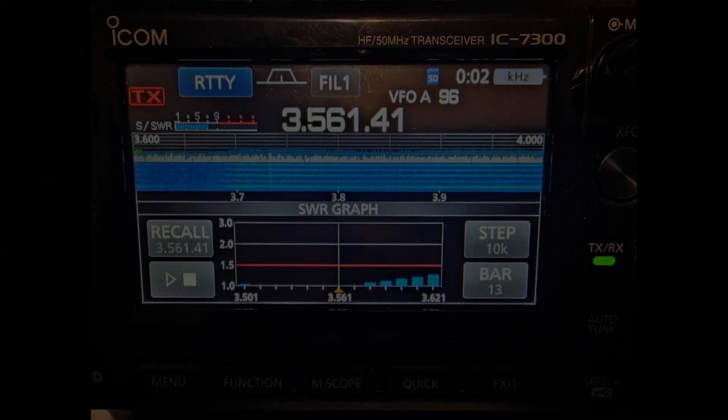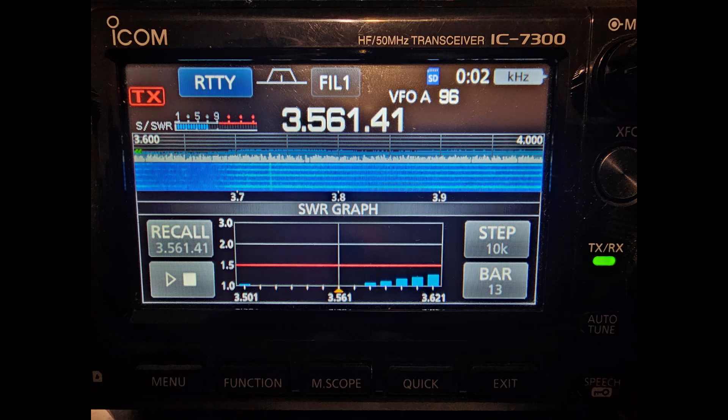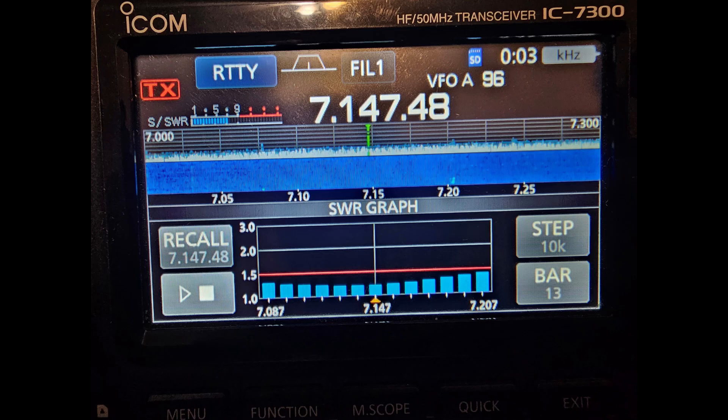So you're wondering how good did it do? Well, this is 80 meters — this is where I was wanting it. It's pretty flat all the way up to about 3.541. It's pretty close to where I was wanting it and this is great. When people ask why do you want to get down that low on the SWR on CW, why not put it on sideband — well, it throws the other bands off. For example, look at 40 meters — see where it is? About 7.147. A pretty good low SWR. Not the best, but with the tuner on the 7300, you've got it made.